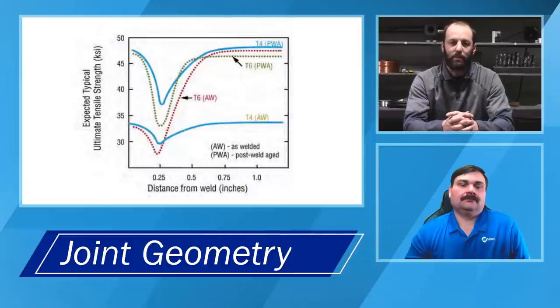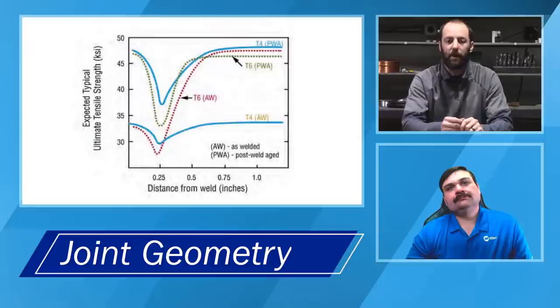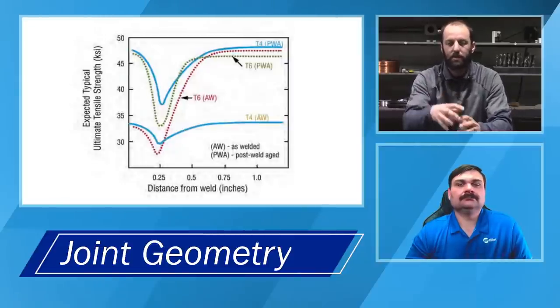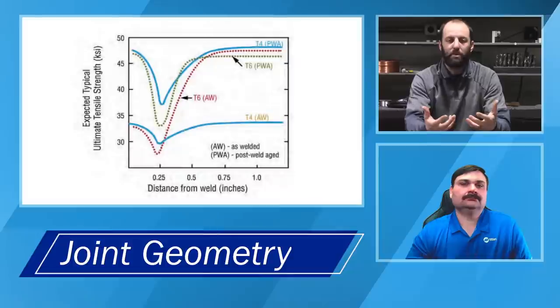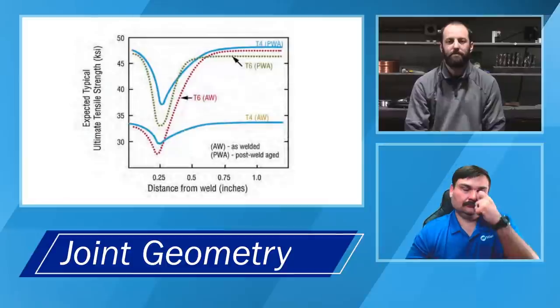One of the best ways to avoid that, if you need to do some sort of a preheat on a component, if you have a nice heavy shop table or something like that, where you don't have to worry about anything catching on fire, preferably your weld table is going to be one of the best options. Take one of those 500 watt halogen work lamps and place it pretty close to that component. Those things get nice and warm. It's a nice dry heat. Let it soak for, depending on the size of the part, 10 minutes, 20 minutes, 30 minutes, an hour if you've got a big part. That's going to give you a nice dry heat and help get the temperature of that component up without introducing hydrocarbons with some sort of a flame-based process.